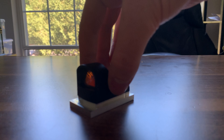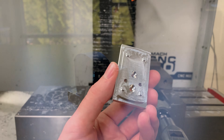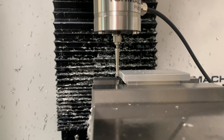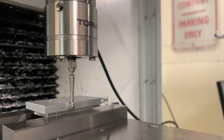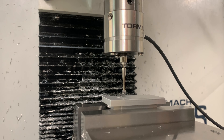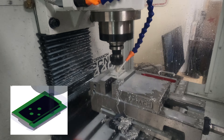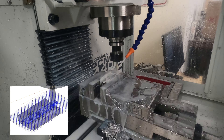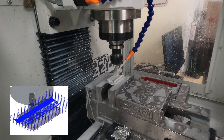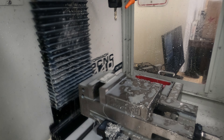I wanted to test fit to make sure the red dot seated properly on the top. For the second operation we're going to flip it over and clamp on the four bosses, making sure not to squeeze too tight so we don't crush or distort them. I'll load up the Tormach touch probe and use the excess material to zero off of it. We only need the quarter inch three flute square end mill for this operation. It cuts a channel down the center of the part and then two angled surfaces that rest against the receiver. The angles weren't standard so rather than buying a custom chamfer cutter, I used the square end mill to make one-thousandth steps with the correct step-over to replicate the angle — the surface finish isn't perfectly smooth but the steps are small enough that you don't notice on the finished product.